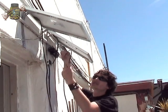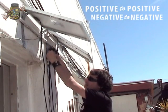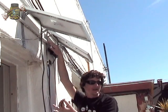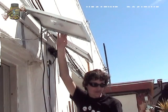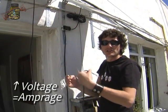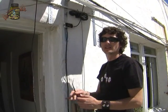What I'm going to do is connect these leads to the same spot that the leads are coming in here — positive to positive, negative to negative. We're running these panels in parallel: the positive output from this panel is connected to the positive output from this panel, and negative to negative. That means we're getting the same voltage but increasing the amperage. If we were to connect negative from this panel to positive from this panel, that's called running in serial, and that keeps the same amperage but doubles your voltage. Parallel means same voltage, double amperage. Serial means double voltage, same amperage. Since we're running to a 12-volt battery through our charge controller, we want to make sure the whole system stays 12 volts, so we run in parallel.